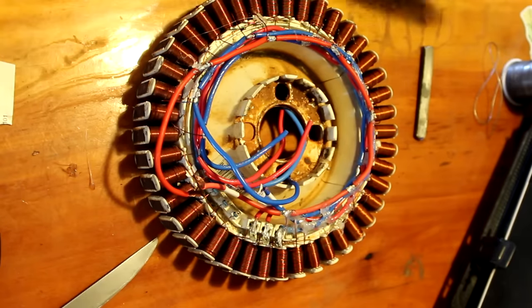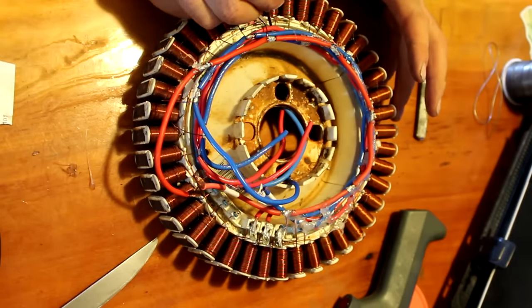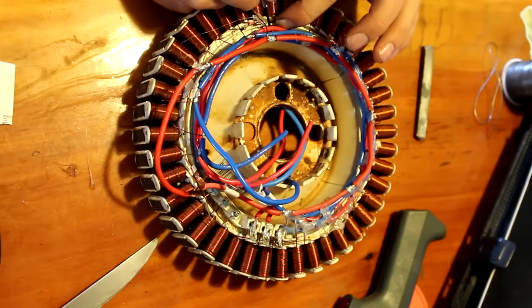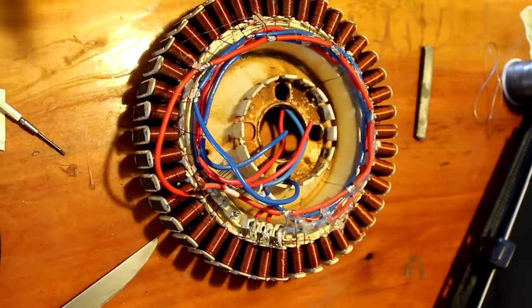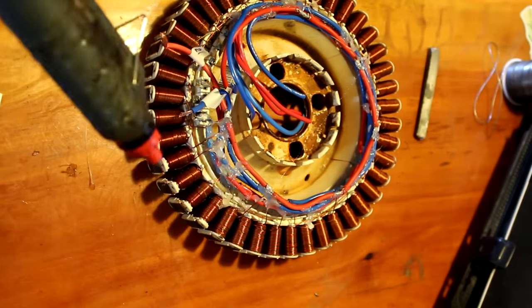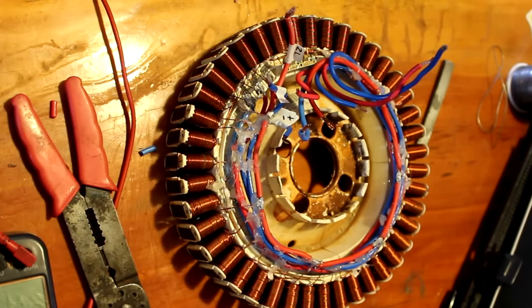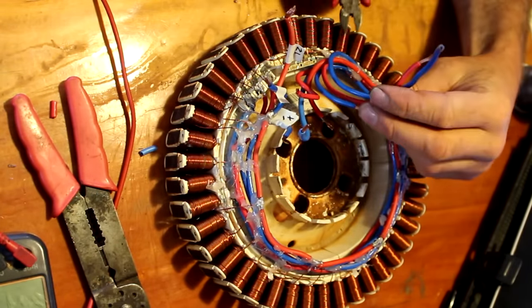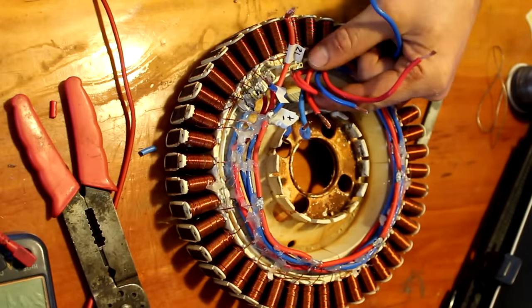Just go around and make sure that there's a few millimeters of clearance between each wire, and if there isn't, you can just make a bit of a gap and then glue it in place to keep it there. Alright, that should do it. So I can actually trim up the ends of X1, Y1, Z1. So we won't need those. We'll only need X, Y, Z here.